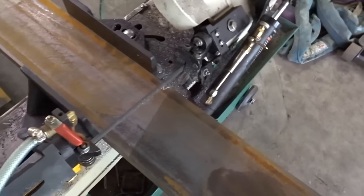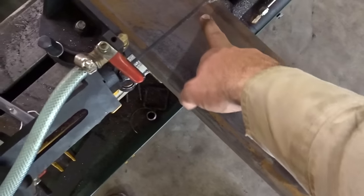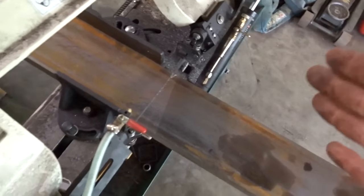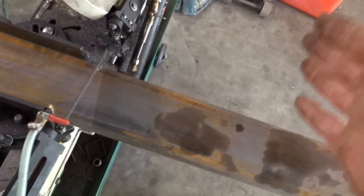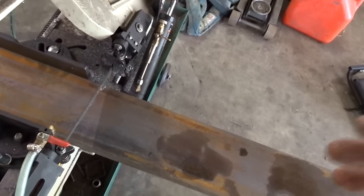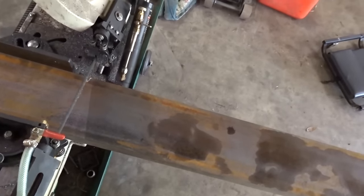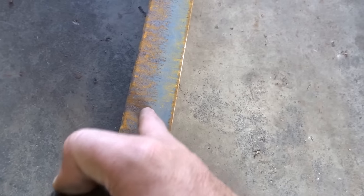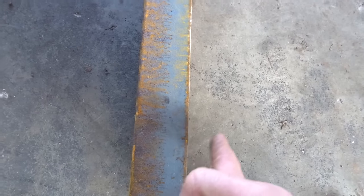So as I mentioned before, we're doing a 7x12 trailer, but the actual main frame underneath, I'm cutting at 11 feet long. So we have two 11 footers for the sides. And on the trailer, they're 9580 axles. So 95 hub face to hub face and 80 inches center to center on the spring perches. So we're gonna go 80 center to center on this channel. Because this is 2 inch wide, technically it's gonna be 82 inches wide on the frame.